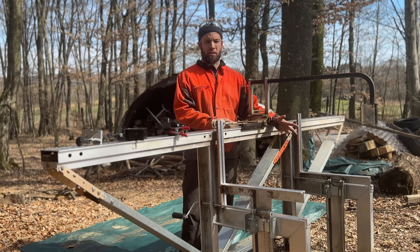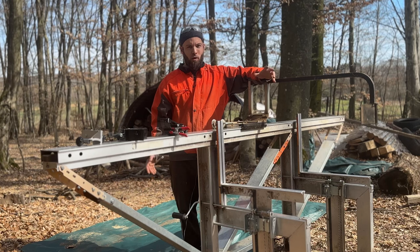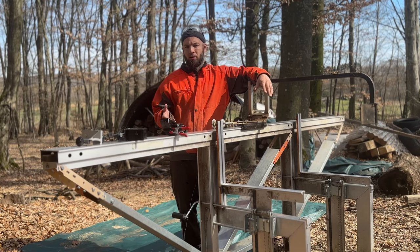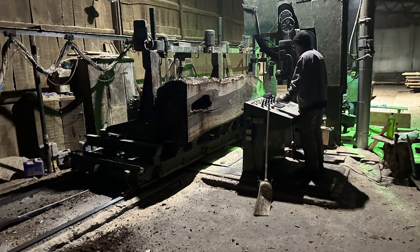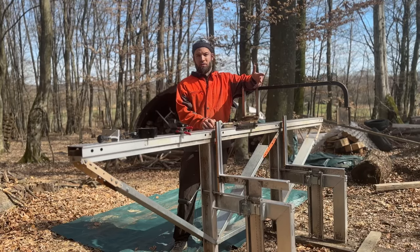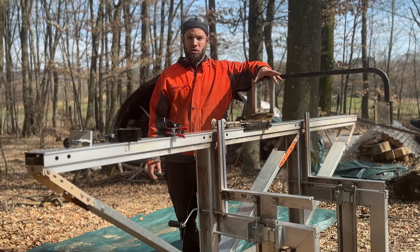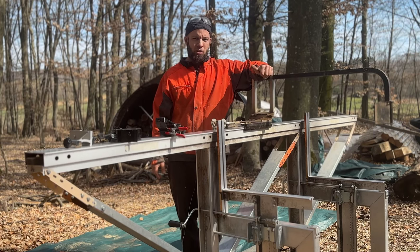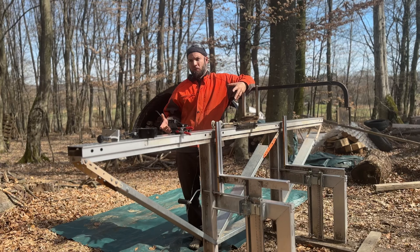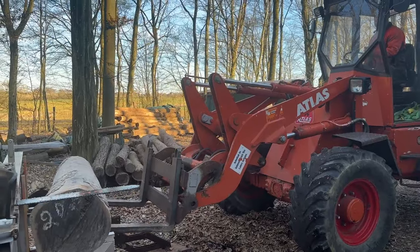Besides, the cuts on this thing are incredibly accurate if the chain is sharp and everything is set right — you will not have waves. I had a really sad story: I brought a beautiful giant ancient walnut — way older than 100 years — to a commercial sawmill where they were rushing. The bandsaw was blunt, even though it was a monster machine, and the boards had huge waves because of the blunt blade. I lost a big part of that walnut. That has never happened to me when cutting with the chainsaw. Sure, it's a bit slower, but if the chain is sharp and the wood isn't really dry, it cuts like butter.